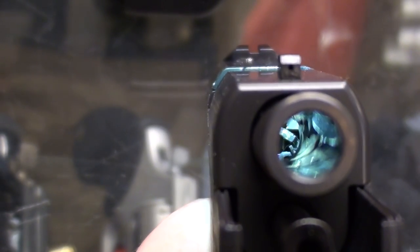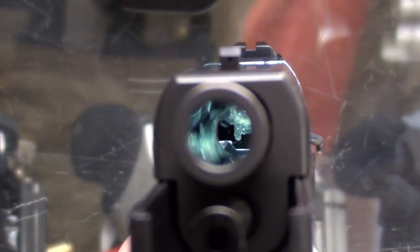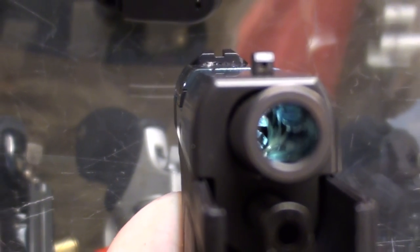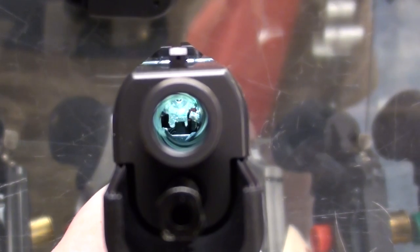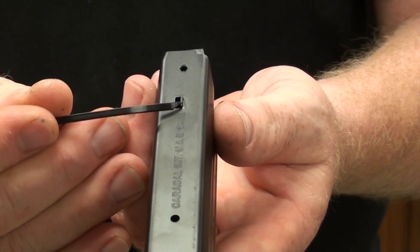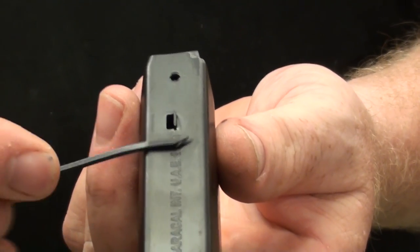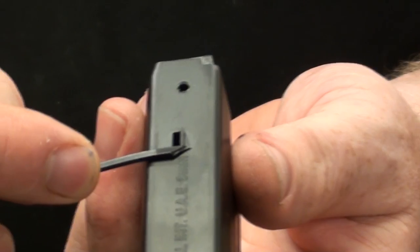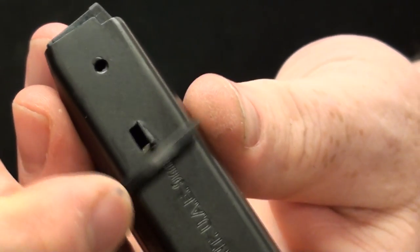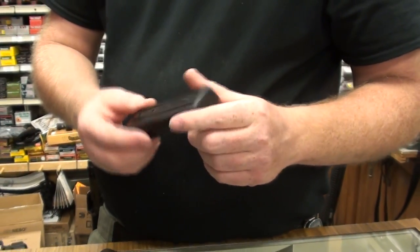Although it's not mentioned in the manual, the barrel is a standard style of rifling. We believe they might be hammer forged, but we haven't been able to get any details on that yet — so they should be a good cast bullet launcher, which is why I mention it. One minor drawback is the magazine design: that small metal-to-metal contact surface is all that holds the magazine in place — the stop rests against the edge of a small bent lip. It's not much surface area, and some drop testing would confirm or deny how much of a liability that'll be.